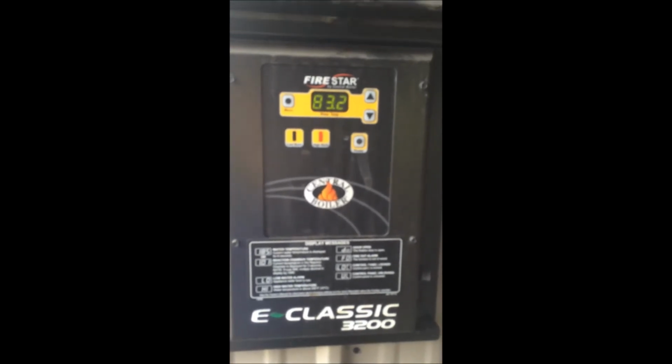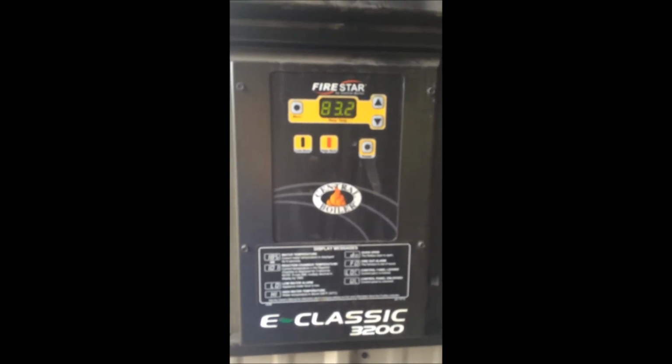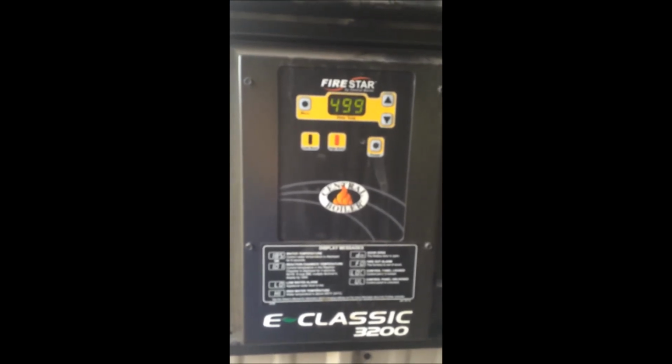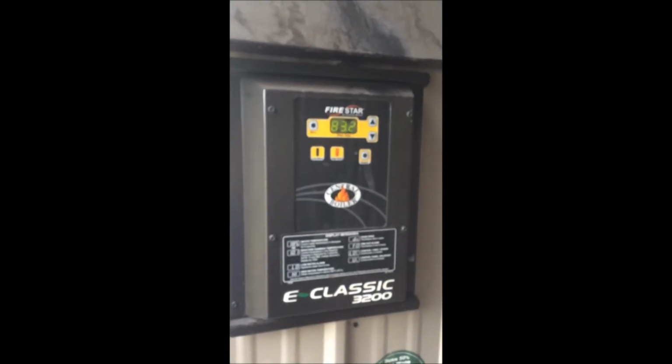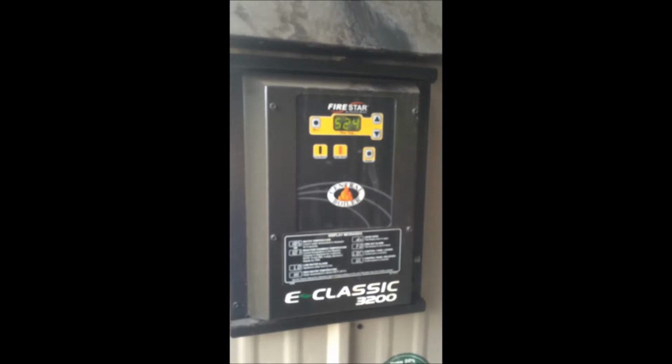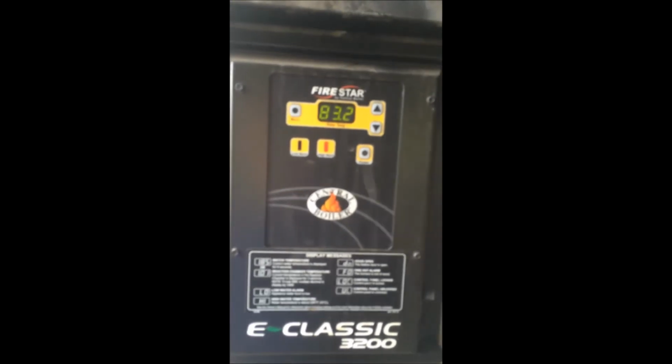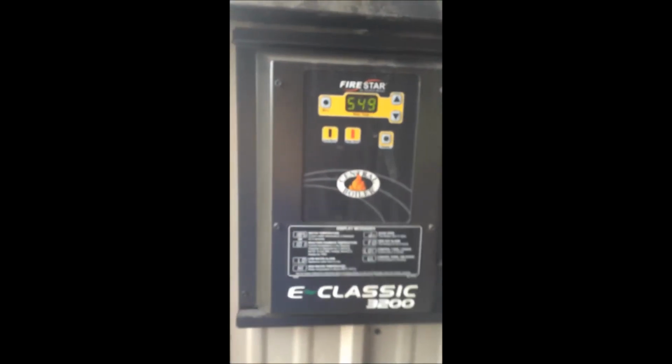It's in a high burn now, so it is roaring away. The highest I think I've seen the box is about 750, 760 roughly. So it gets damn hot in there. The idea of the biomass is that it burns the smoke that would normally go out the chimney. It ignites it because it's got gas in it that we can utilise and burn, for an efficient system. You see now at the chimney there is not a single bit of smoke coming out of it. It is that clean.